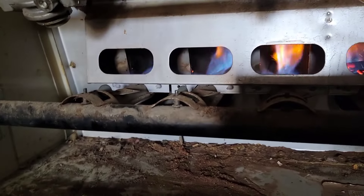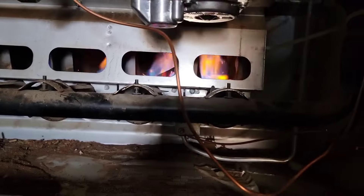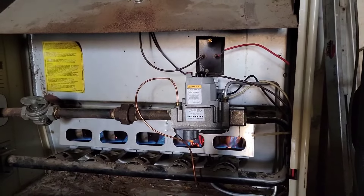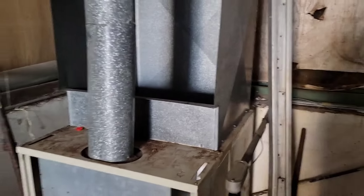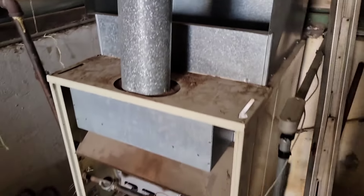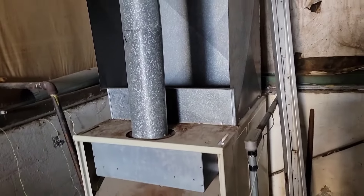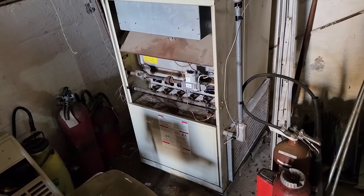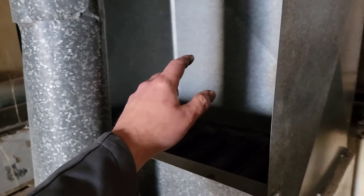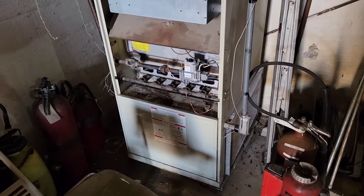Hope you know how to light this type of furnace now. Look at that big old yellow flame. Should hear it click and the fan should kick on — probably don't need to stand in front of this thing when it does. 80%. We're waiting. You can tell this is a five ton furnace right here, 125,000 BTU. It's alive — fan is blowing. We are working.